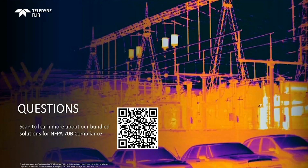It would probably be better to use less contrast as opposed to more contrast, meaning if you're working with an arc flash face shield over your eyes, a gray palette or an iron palette, in my opinion, and again, that's an opinion. Some people might be able to work better with a face shield in something like rainbow high contrast. But I always found that it was easier, either in gray or iron, to see the screen and see either bright or dark better with less color as opposed to more color.